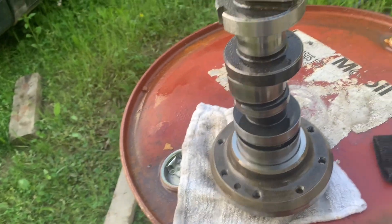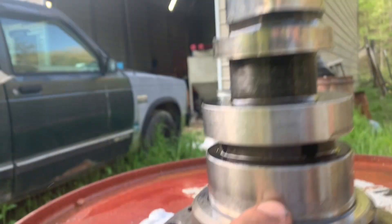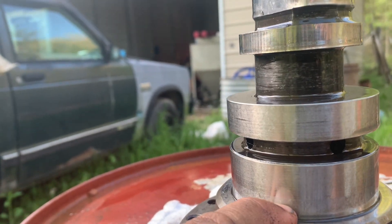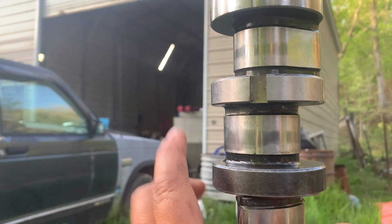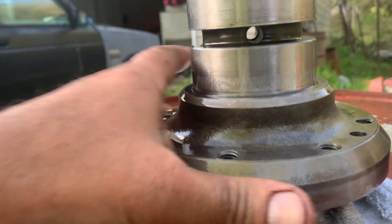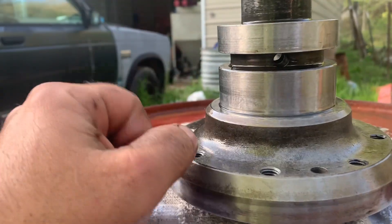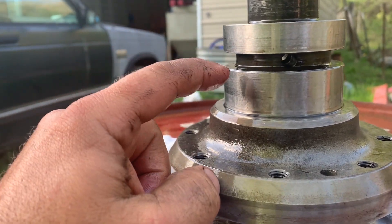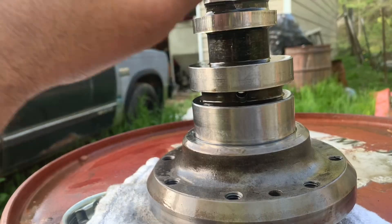Some significant places here. You actually have three cam journals — here, here, and here — in the housing. That's bearing; the rest of these are not. This one here is very significant for pinning the pump to top dead center. This collar will slide off — it's just sitting down on there. We will stack a thrust plate and bearing thrust plate on this before it goes in.